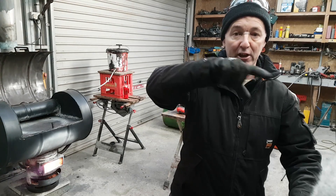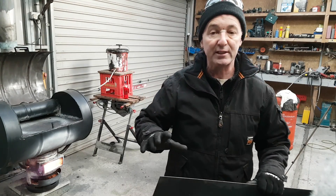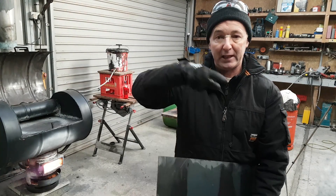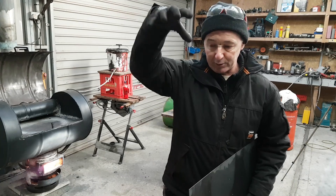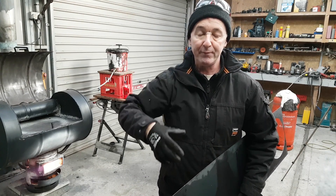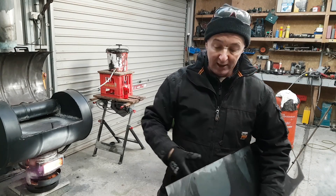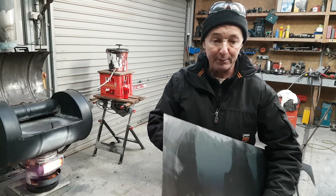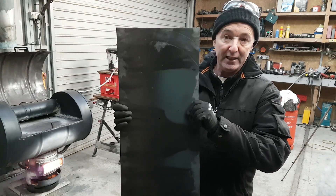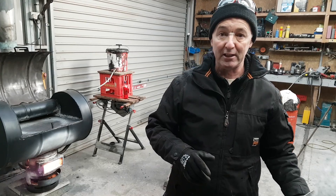I need a big circle — I need to put a rim all the way around the propane bottle, and I'll show you what that's for in a few minutes. I don't actually have enough material. If I had a big sheet of plate steel, I'd just put the cylinder on it, mark around it, cut a circle, then cut another big circle and end up with a big ring. But I don't have enough material, so I'm going to cut it in segments and make this work.